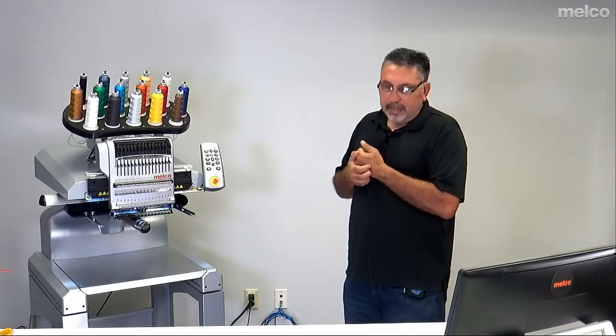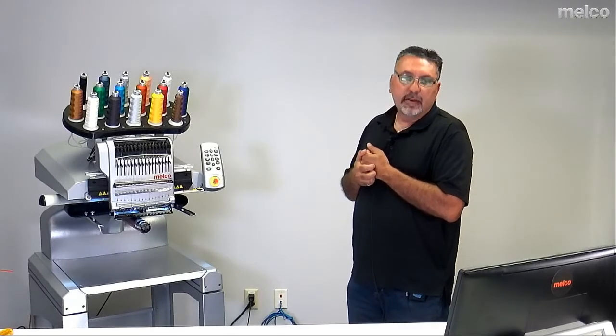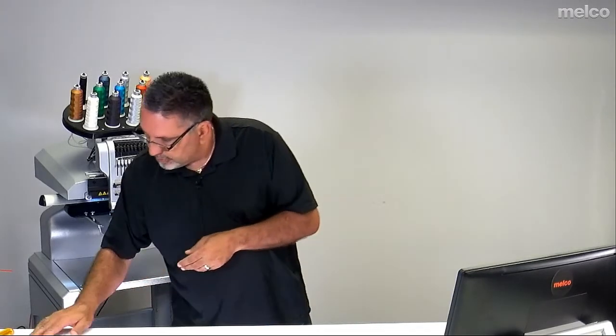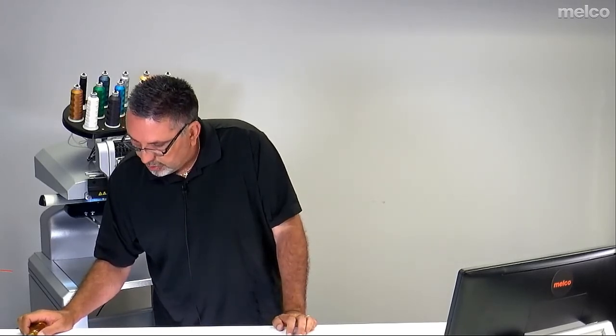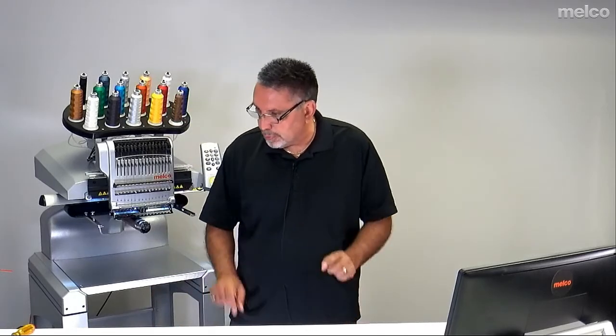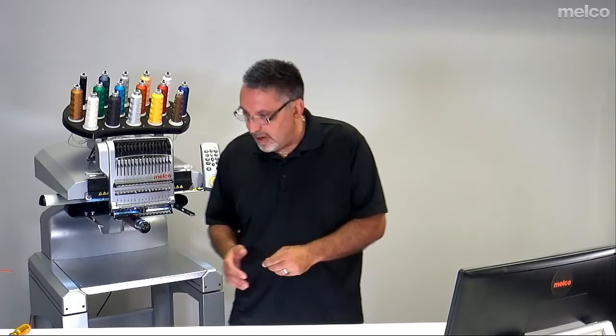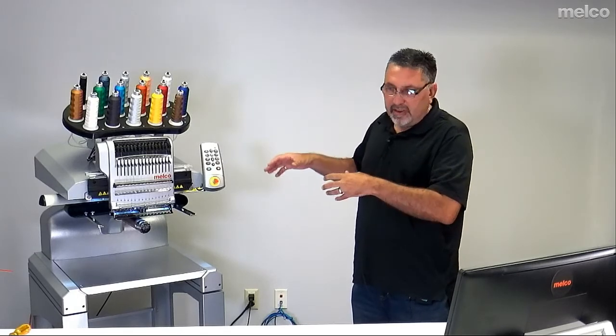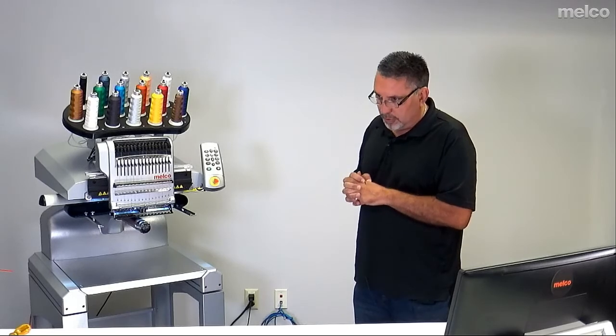One of the other things that you might run across is if you are getting some mistrims with your NPT trimming system. Of course, one of the things you can do is you can go to www.melco-service.com, and if you go to the FAQ tab, and I actually wrote down the link, okay, FAQ, Help Center, Knowledge Base, Machines, See All. There's a tab in there for EMT16X (NPT), setting the knife home. So that is a very useful document to make sure that all of the mechanical settings for the NPT are in the correct position for it to work also.